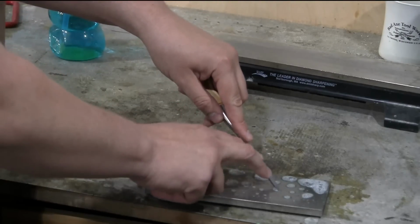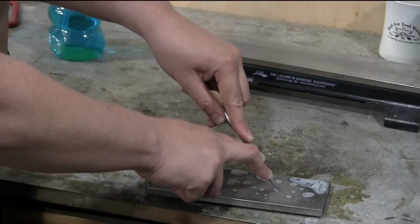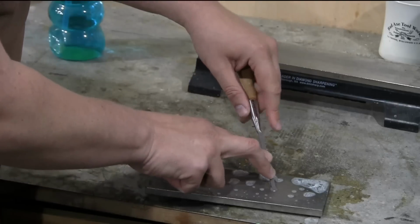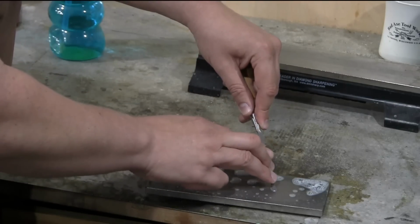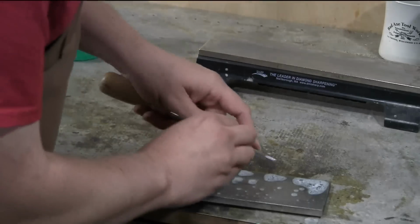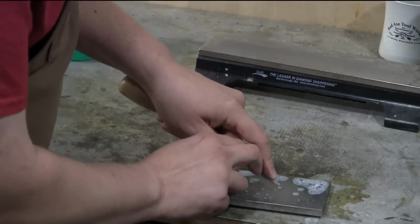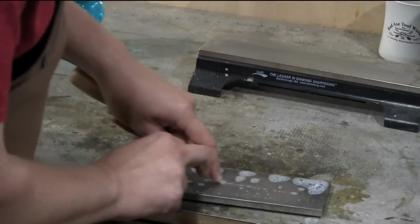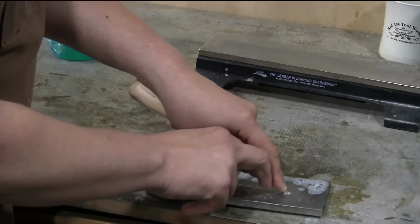Skewing that gives me a little bit more surface area. I've got a little bit less rotation as I skew it. But more importantly, I'll skew it really far, like almost sideways at this point. And I will put 2 or 3 fingers right down here close. If I'm normally sharpening, I'll kind of choke up on it. I'll put the handle of a chisel tucked into my hand, and I'll do this type of action. And you can very quickly rock that from side to side a little bit.